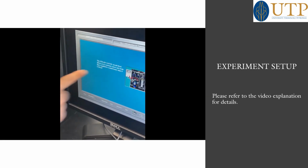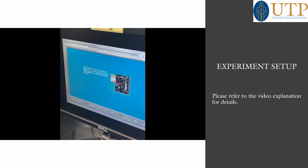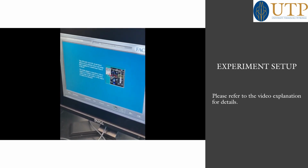The strain gauge circuit block allows you to measure stress and strain that is applied to a metal beam when it is flexed. The strain gauge is a transducer whose output resistance is a function of the strain on the surface of the object to which it is attached.